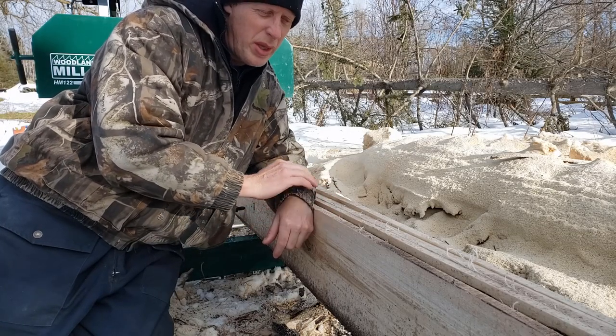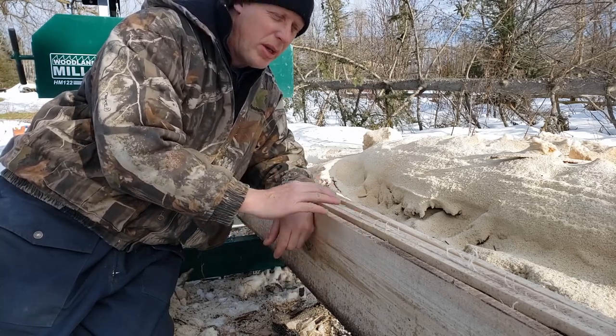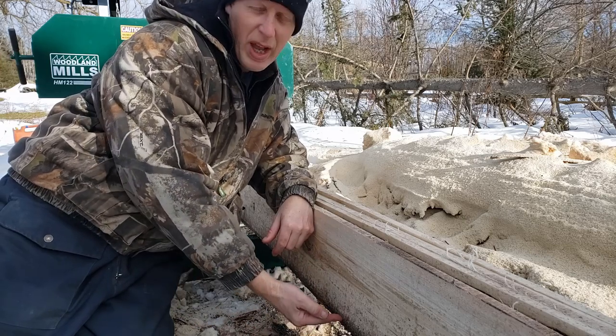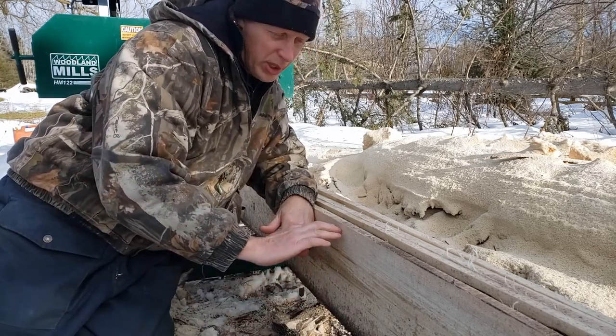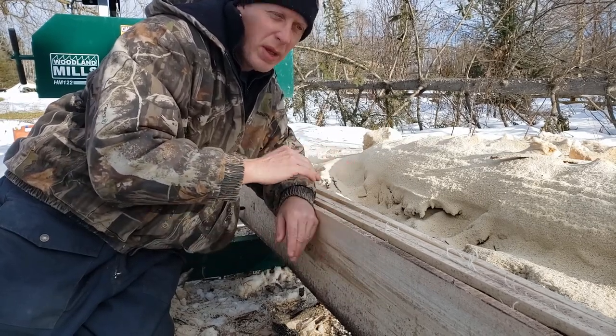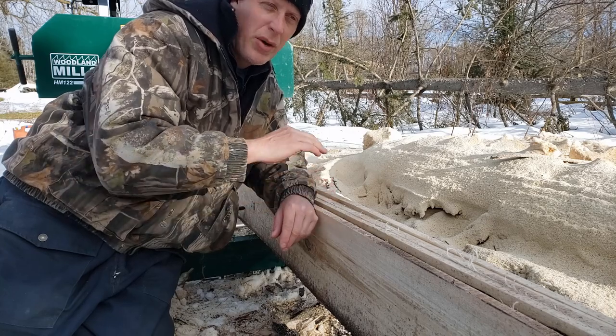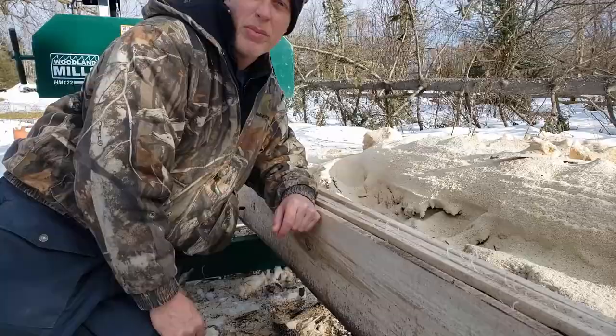Have our boards cut to thickness. They're all uniform thickness. They're all sliced on the sawmill. The next thing we've done is we put them live edge down. So now all the live edge are touching the bunks on the sawmill, and we're going to come across and skin off just the top layer, making them all a uniform width. So when we go to put them on for siding, they're all going to basically lay out perfectly level with a nice live edge on the bottom.